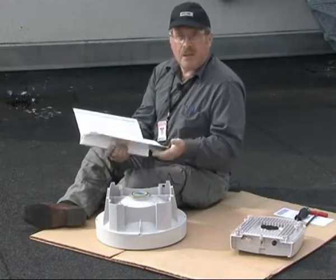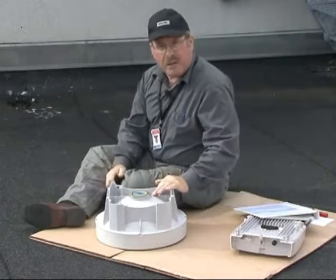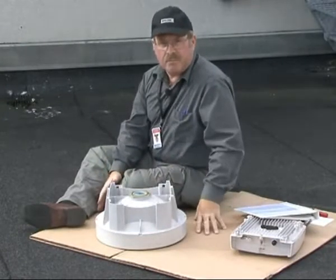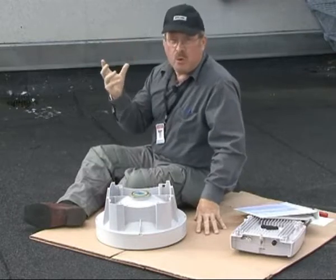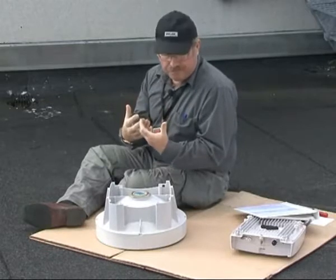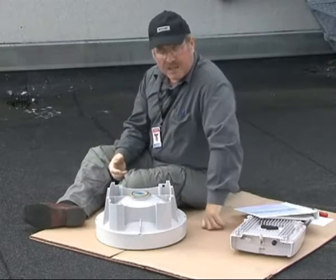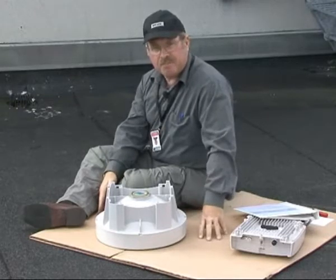At this stage, I've got to point out that the mechanical unit assembly and modification must be done on the ground. When you're working at height, you are limited as to what you are able to do when you're clinging tightly to a mast or a tower. Also, use a bit of packing material to protect the equipment from an abrasive surface.